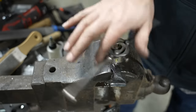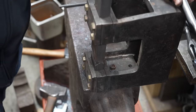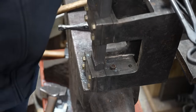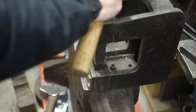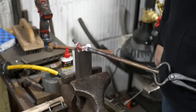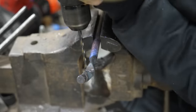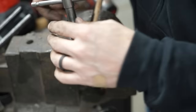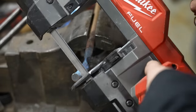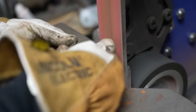The next task was to make the thumbscrew that's going to close this vise — I wanted to forge it from scratch because an off-the-shelf piece just wouldn't look right. I grabbed the guillotine tool again with my rounding dies to create a butterfly-looking shape with a series of rounded sections, then drilled and tapped it. I use one of the guillotine dies in my vise to get things flat, drill a number-7 pilot hole, and run a quarter-20 tap through it. Then over to the 2x72 grinder to clean up the curved sections — it came out really nice.